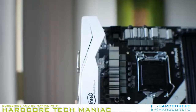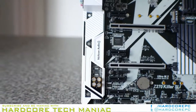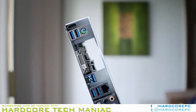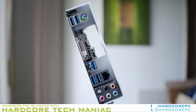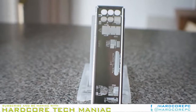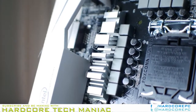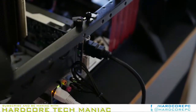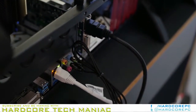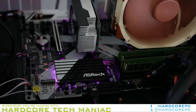Yet the only real downgrade we see compared to other $150 motherboards is the older Realtek ALC892 codec, where others typically have the newer ALC1220 codec. Formerly a high-end codec, the money-saving ALC892 is still widely considered good enough for the vast majority of users. If you need an onboard Wi-Fi, Bluetooth controller, or even if it's just convenient, that's not much of a trade-off.